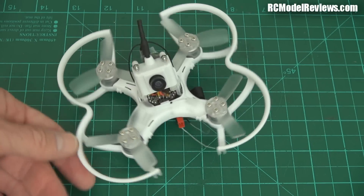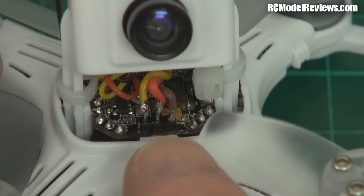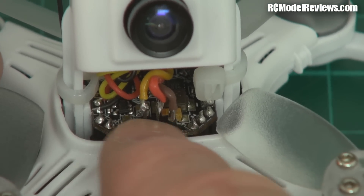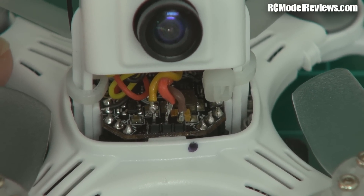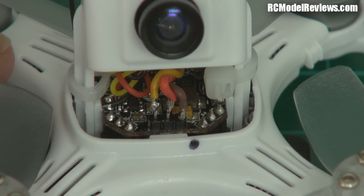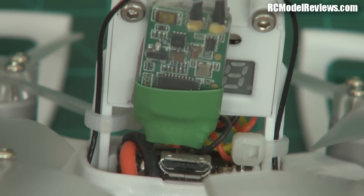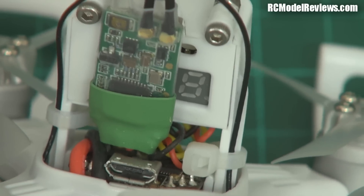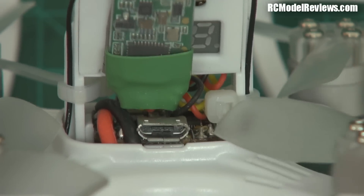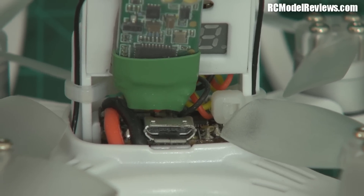To fit this receiver I had to do a little bit of fettling and soldering. Under the camera down here are three little pins that poke out of the board, and you have to connect that up to your receiver. You could plonk the receiver right on top and solder directly, but that makes it difficult to remove if needed. So I ran some wires from those pins around the back to the receiver, which I stuck on the back of the video transmitter — a 40-channel video transmitter with an LCD display and a button for changing channels. There's also a micro USB port for tweaking your flight controller, and if you're buying the plug-and-fly version you will have to set it up to your transmitter.